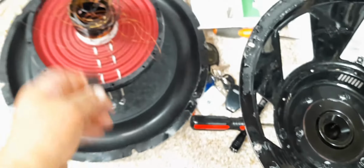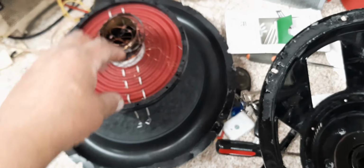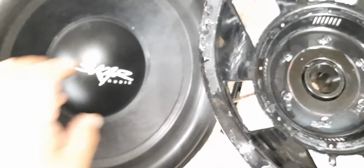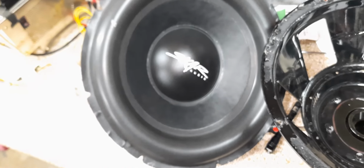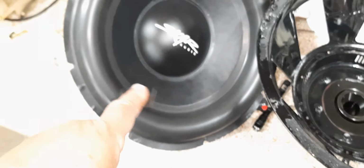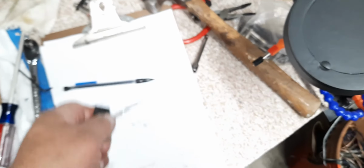Everybody cuts these. I'll bust this out. I can damage this to get it out. So I clean that up and I can slide a new coil right back in there, in that spider, without even messing it up. And then the only thing I got to get out next is the dust cap. And I'm already working at that. Put that down in there. And I'll do a couple coats of the glue to soften it up, and then get that cap off there without damaging anything. If you see it start tearing the paper, back off and lift somewhere else. Just pry around it with a small razor blade or a small, I use these little teeny screwdriver for glasses.